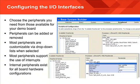Note that not all of the I/O interfaces are required for you to use. Likewise, internal peripherals, that is, those peripherals that don't connect to I/O pins, can be added to any design on any demo board, of course as long as you have enough FPGA resources to add the component. Now, most peripherals support the use of interrupts, and EDK supports you adding a custom interrupt controller, and that is one of the labs as well as one of the discussions we have, as part of our standard embedded system design.